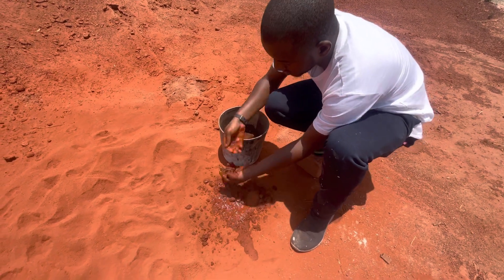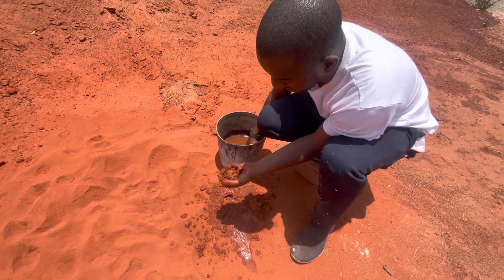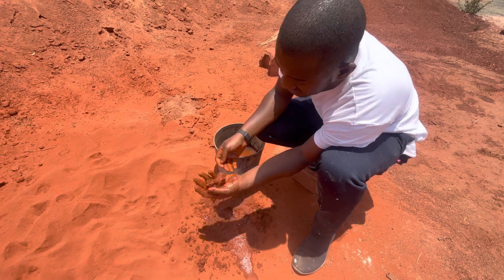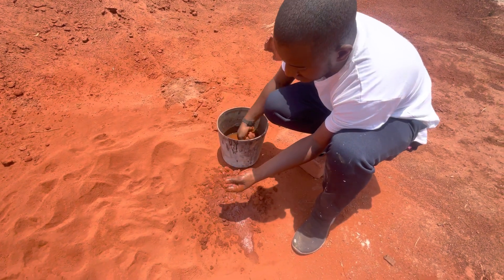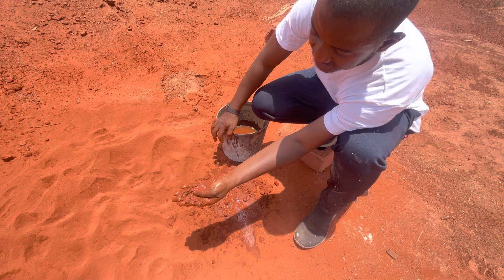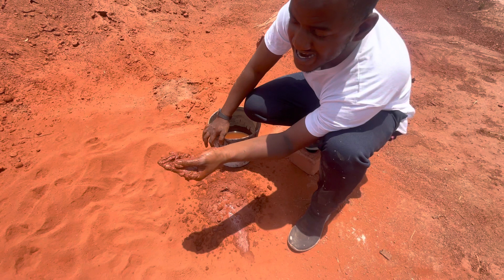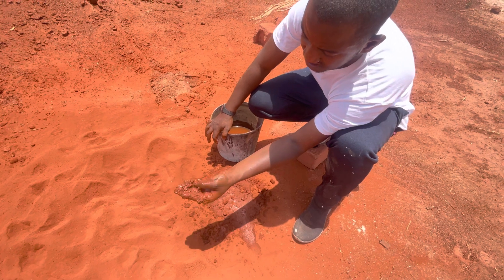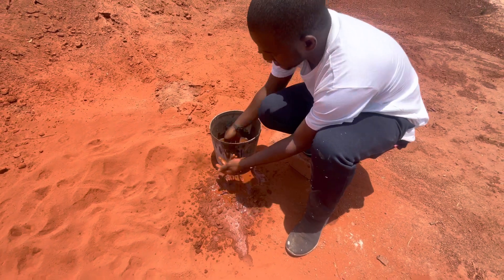Based on this test we can say that this soil has less plastic content in it. From my experience, even by doing this I can tell it's more sandy than clay, which means it's not very sticky — because it has a lot of sand grain in it. Sand is not sticky, but clay and silt are.